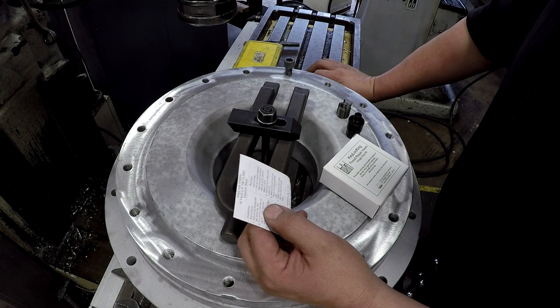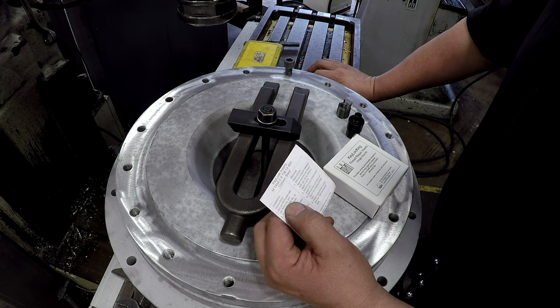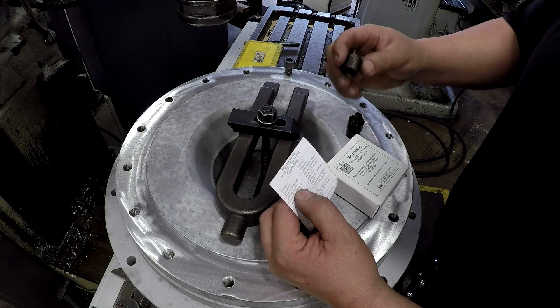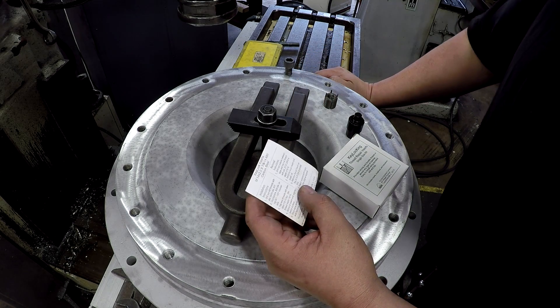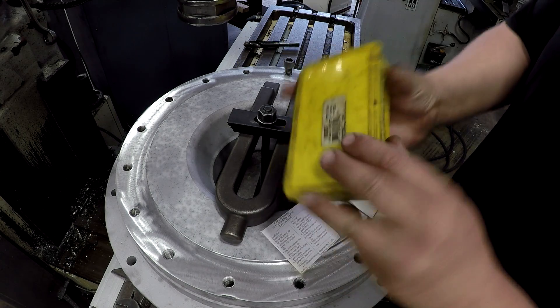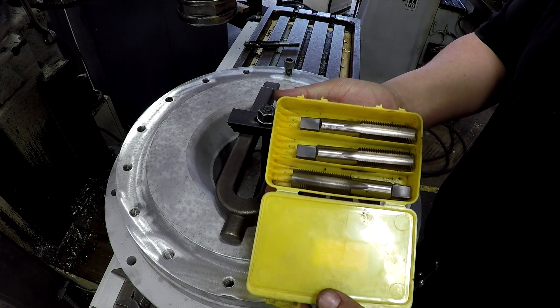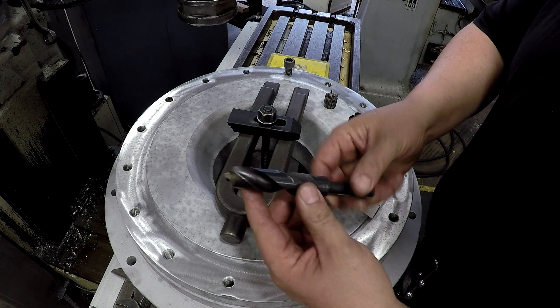It tells you the proper drill size, because you usually have to go about one drill size over for these threads — it's not a full depth thread on the OD. And then of course you've got to have the right tap; in this case 7/8-14. So we've got a nice 7/8-14 tap set here and a 53/64 drill bit.